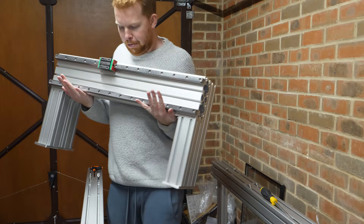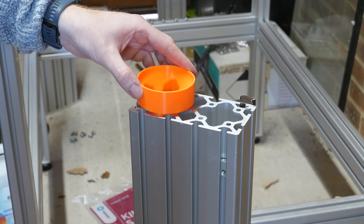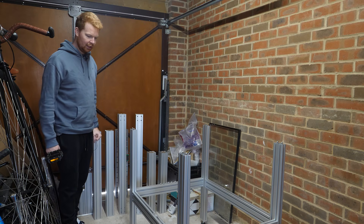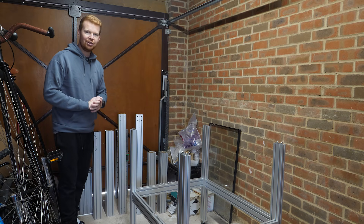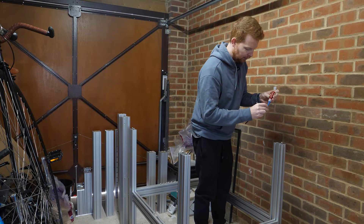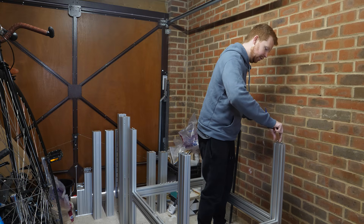The next step was to fill the gantry, which because of its double 8080 width design requires a new funnel for pouring in the sand. This new funnel is a little smaller but it still works well and prevents any mess. Now that all the beams are filled with sand and resin it's time to put it all back together, which wasn't easy the first time around and now it all weighs about twice as much. This also means re-thread locking all the bolts, because if I don't do that they may not be secure and there's nothing worse than loose bolts on a CNC machine.